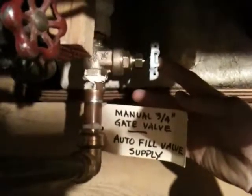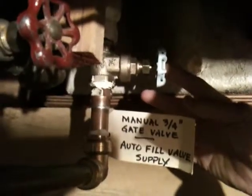And then we are back to where we started — the main water shut-off valve. We keep this shut off just as a safety measure. Turn this clockwise all the way in until it hits the stop. Not too tight, just snug at the bottom.